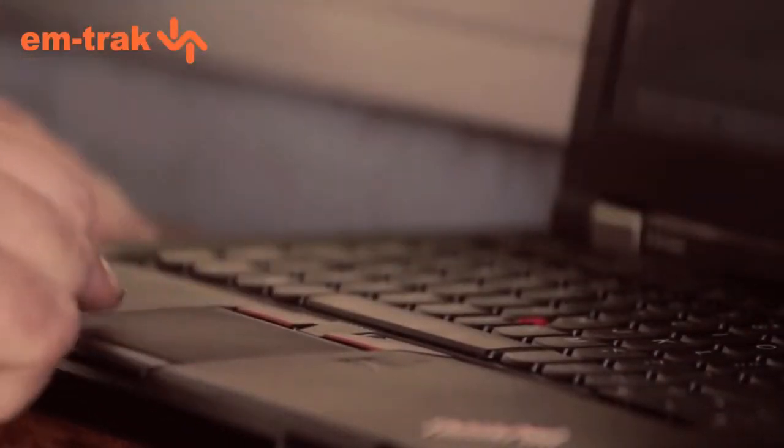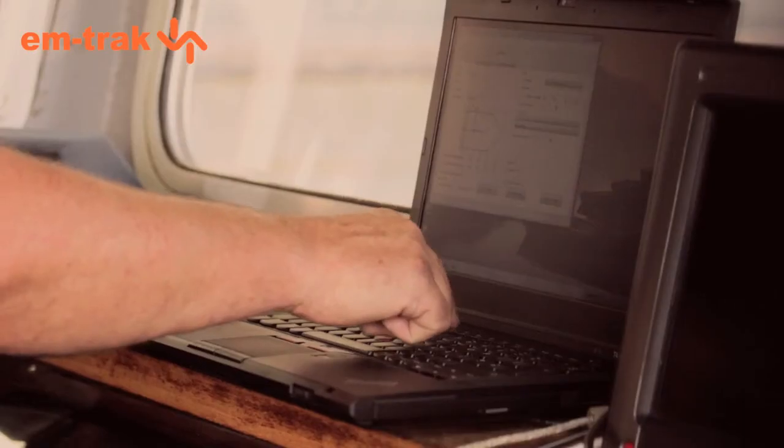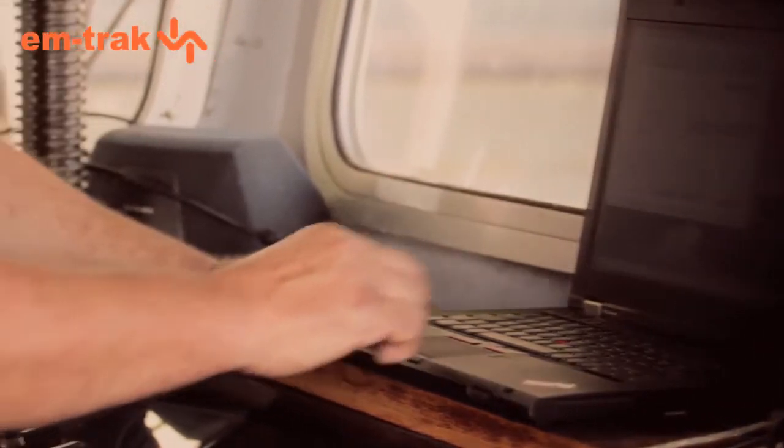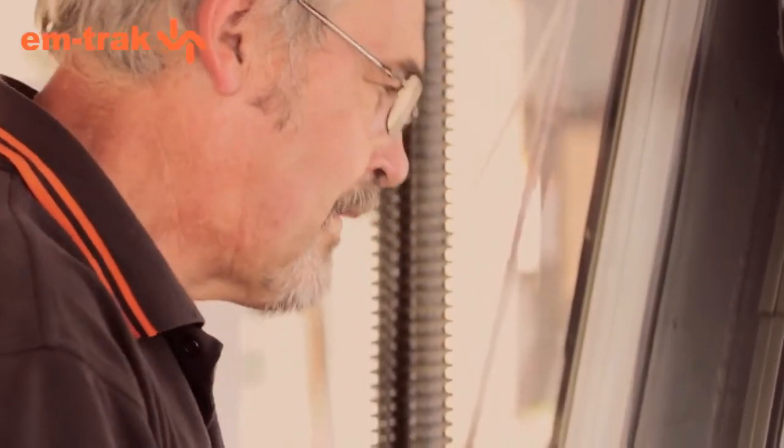In this case, we've connected a laptop to the Class A and are entering the details as instructed. The program will ask you to check the details are correct before finally programming the unit. And that's it — your Class A is now fully installed and configured.